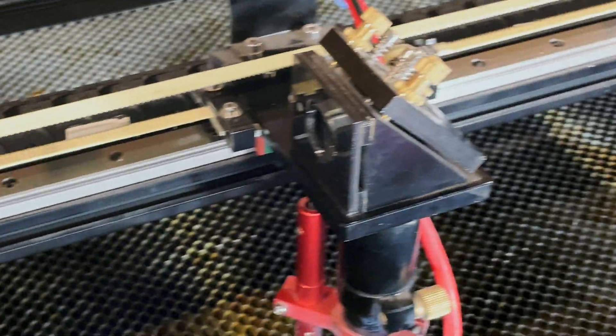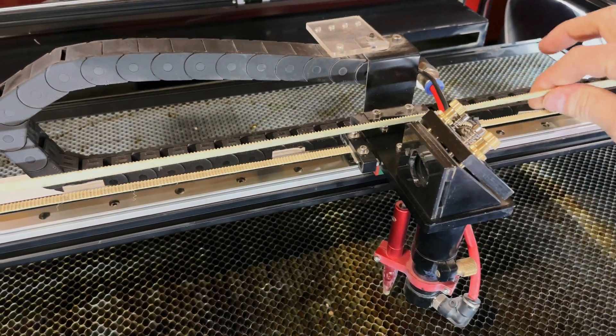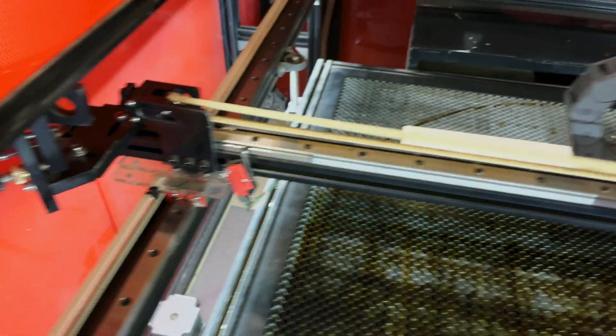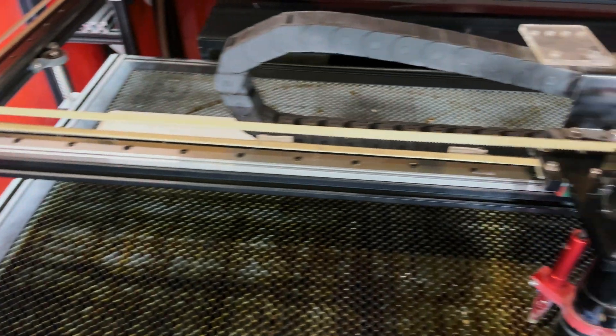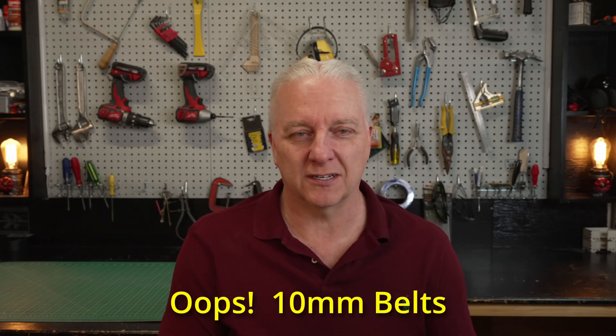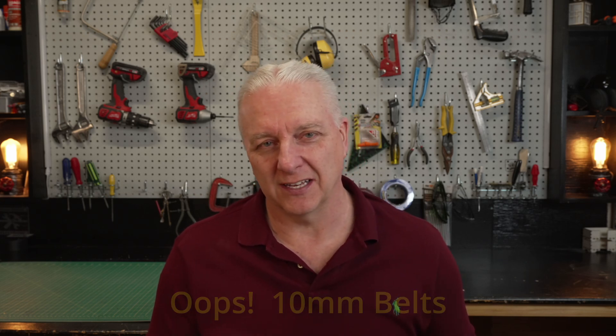The big elephant in the room — which I knew when I built the laser — was going to be the belts. I chose six-millimeter belts in part because they're cheaper and you can buy lots of different parts to support them. Particularly the one on the gantry seems a little weak. It does bounce around a bit and causes a bit of whiplash as it's trying to move that big laser head back and forth. I haven't fixed that problem yet — I've just simply slowed the laser down a bit. However, I do have wider belts, pulleys, and all kinds of kit on order — just hasn't come in time for this video. I'm going to upgrade at least the gantry, probably all the parts, to wider belts just to make it a little more industrial strength and get rid of some of those oscillations.